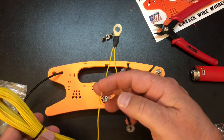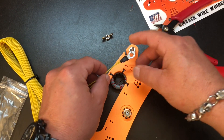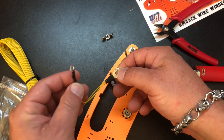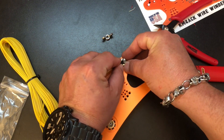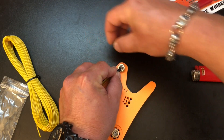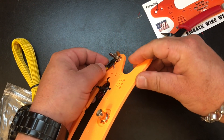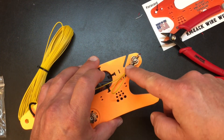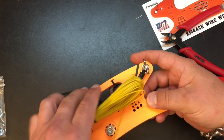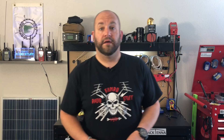And now the last thing to do is add the wire. This already comes pre-connected just like this. This guy is like the strain relief. You'll notice this one's bigger and this one's smaller, so we're going to put the bigger one on first and then the smaller one on, and then our wing nut — screw her down like such. And we have an antenna! Now all we need to do is go outside and trim this down a little bit and get it resonant. We should have this angled in like this so when we wrap the wire winder around it, it'll hold it. So let's go outside and get her up in the air, start cutting some wire, and get it resonant.